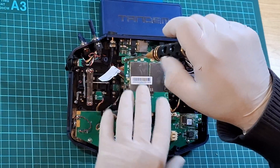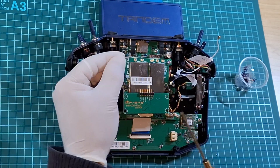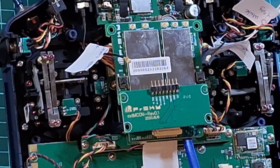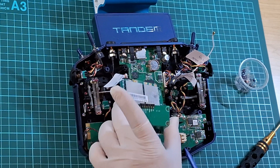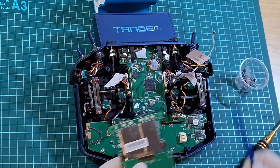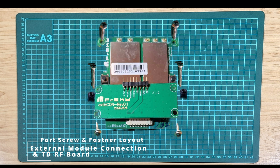Just an aside: on the X20 series transmitters, the logic boards stack one on top of each other a little bit like Lego does. Bearing that in mind, we'll disconnect the RF and external con board. To remove these two boards as one unit, place your spudger underneath the RF board and gently lift up — it should easily pop off. You'll notice that the two boards are held together by a serial cable, so there is no need to disconnect them. Here is a schematic for your reference of screw positions and sizes for each socket — I'll include a schematic for every logic board removed from the transmitter.